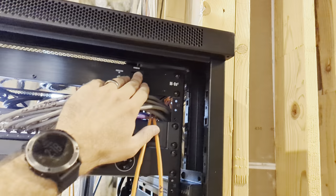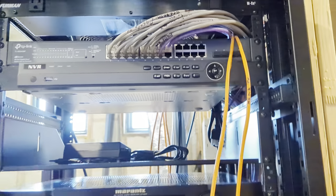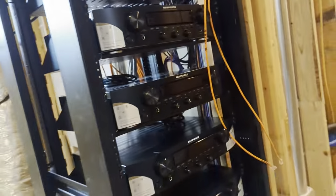I like to put these in here — just a real simple off/on, you can kill the whole rack with it. Gotta be careful though. I've got a lot of amps in there. You kind of want to do two circuits when you're dropping eight amps in a rack — make sure you have enough power.